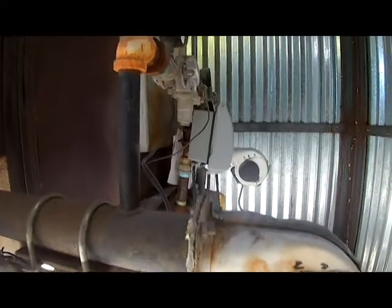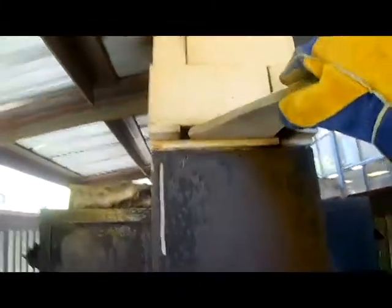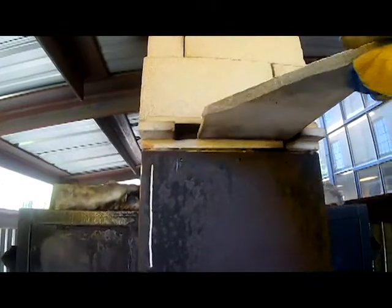With the burner here, this is how you can control the air flow — more air or less air. It's pretty simple. There's also the gas here; you can control how much fuel goes into the kiln. And then finally we have the damper, which controls how much output — how much flow — goes out of the kiln.